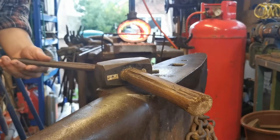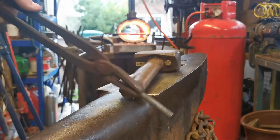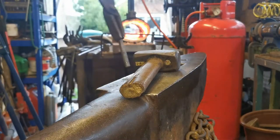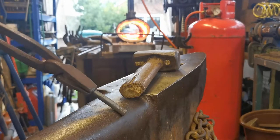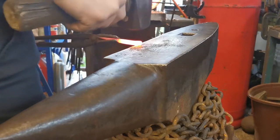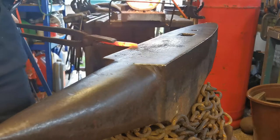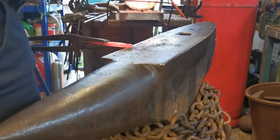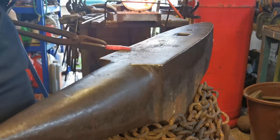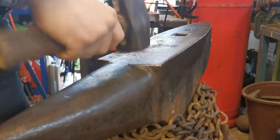We're going to isolate it down - picking it up, handle first - and we're going to draw this material out, and that will loop over to create the loop where we're going to put the ribbon in, so we can hang it on the tree. We're going to stick this in the forge and keep drawing it out. I'm just going to use the near edge of the anvil just to taper, and then we're going to isolate this material, so we've only got a select section of material being thinned down to be used. I'll form this out and blend everything in.